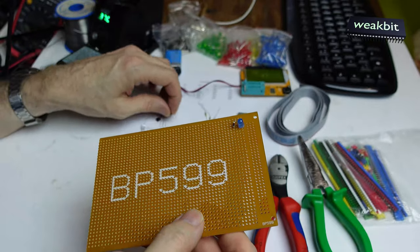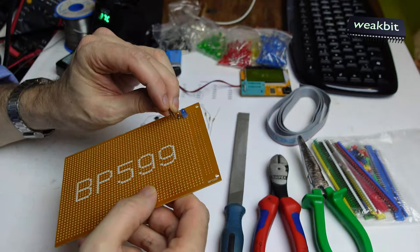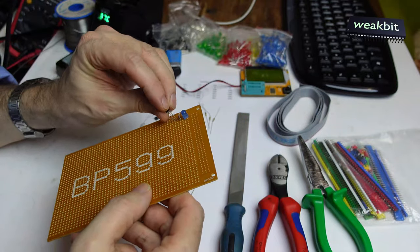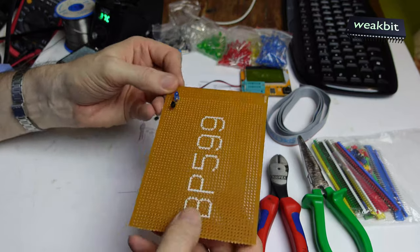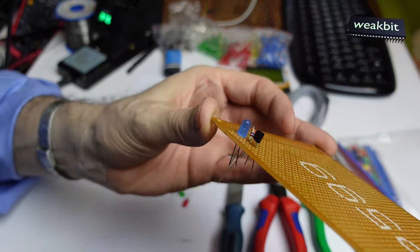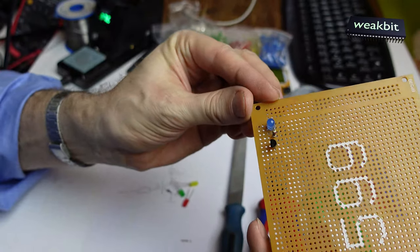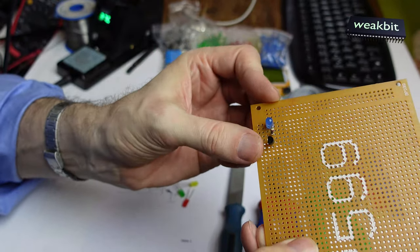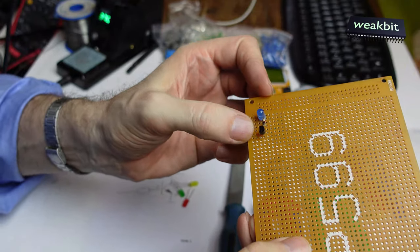And then we take the transistor, and this should be collector, base, emitter. This transistor, looking to the left, you can see it. Here's the flat side on this side. On the left is the flat side. That means collector, base, emitter.